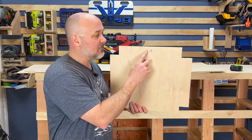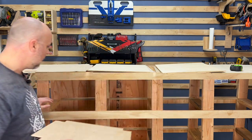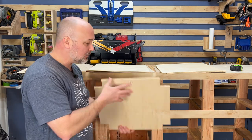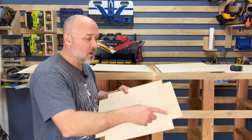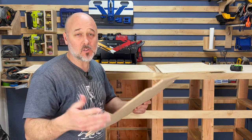Adding supports for the quarter-inch plywood shelves will prevent any bowing — they are optional except for the back of the large unfinished plywood face. To do this right I had to custom cut each shelf. When doing the custom cuts on the bandsaw, jigsaw, or scroll saw, make sure you mark them so you know exactly where they go, because these sizes are custom fit. I mark the back — F for front, row one, column two — so when I place them I know the orientation and don't mix up the custom cuts.